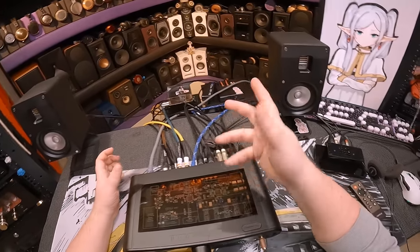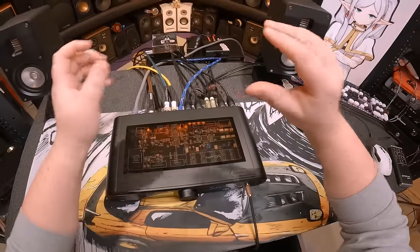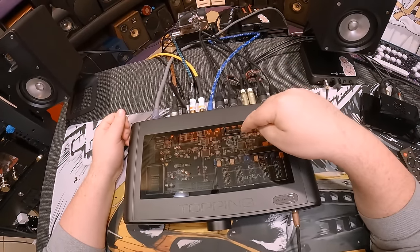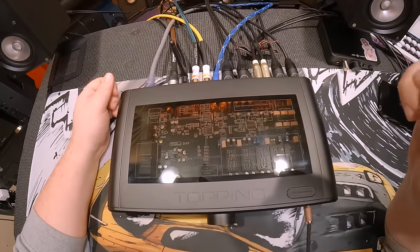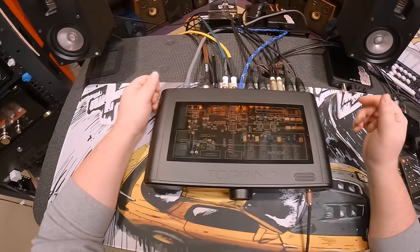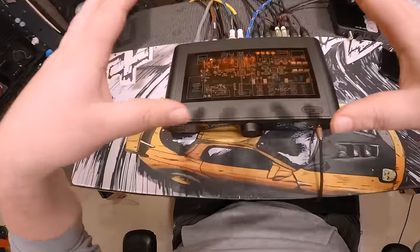A resistor ladder hybrid. So it's doing a little bit, but then it's clicking over and doing an entire, clicking over and doing that. So it's very, very good digital volume. Here's your AK4499 DAC, which is the top of the line AKM DAC sitting right there. Your low noise drivers, your high performance IV converter, DC surge protection, and so on.